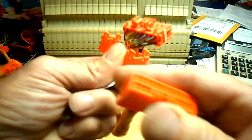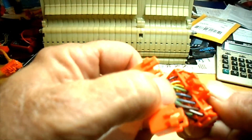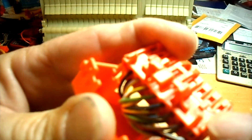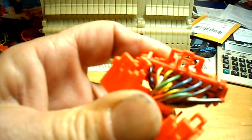Here's our 12s BMS plug. This end plugs into the BMS satellite; this end plugs into the module. This is with the top cover peeled back, so all those wires are hooked in there good and solid. There's no exposed terminal back there, so even if you snip it right at the crimp — the crimp would be this metal thing up in here — even with one wire flapping around, I don't see where it could get into one of these other openings enough to cause a short.